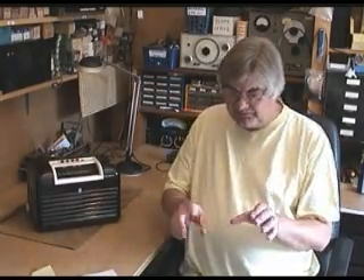We tune our dial on the radio — you turn the knob, tune the dial to 5 MHz, and you're listening to a radio station there. The local oscillator, when you tune the knob with the vanes meshing inside on the tuning gang, is running at 4 MHz. So your radio station is coming into the mixer on 5 MHz, your oscillator is injecting its signal into the mixer at 4 MHz — the difference is 1 MHz. So your IF frequency will always be 1 MHz. It doesn't matter where you tune to on the dial — it's always 1 MHz.